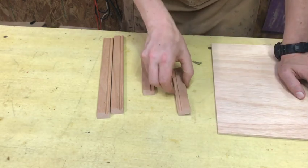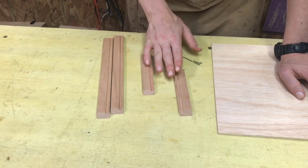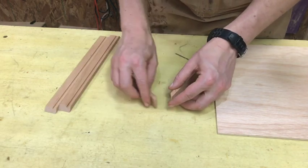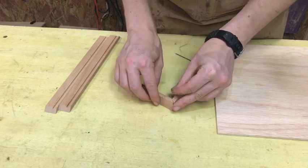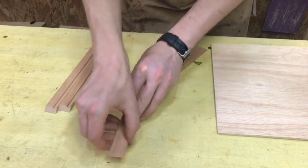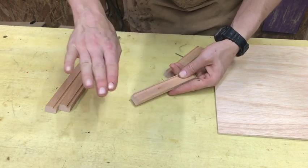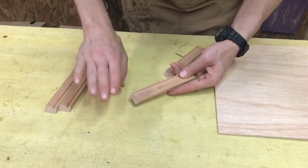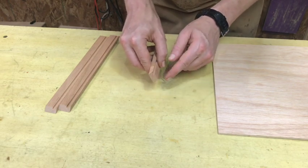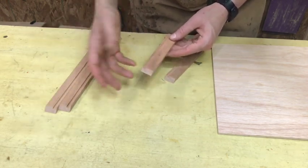While this is drying, we're also going to do the inside sanding. I'll show a minute or something of this, but I just want to point out that you want to avoid hitting these corners. One thing that makes miters glue up really well is if both pieces on the ends where they connect are even thickness. So when I'm sanding, I either get something very flat and I count my strokes and go both ways to apply even pressure, or if I'm hand sanding, when I come to the edge, I kind of feather up and off. You want to go right up to this edge, but not get the edge. If you start rounding this over, it will have kind of a weird rounded inside gap there. I don't know, it just doesn't look great in my opinion.